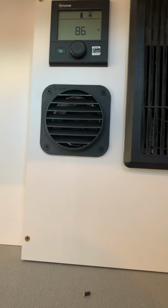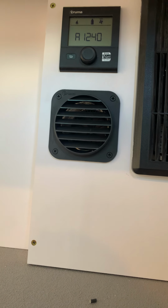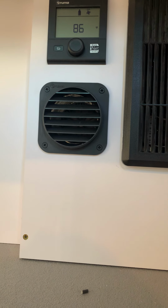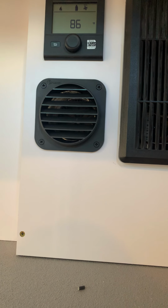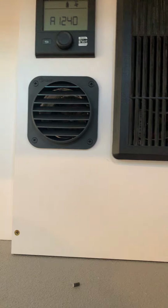If the display has an error code, it'll say E and some numbers, or it looks weird other than what it looks like right now, that means there's a failure. Typically, there's a gas leak. If you get one of those errors, you need to fail the inspection. You need to contact me or let an engineer or Devin know. If you have any more questions, just let me know.